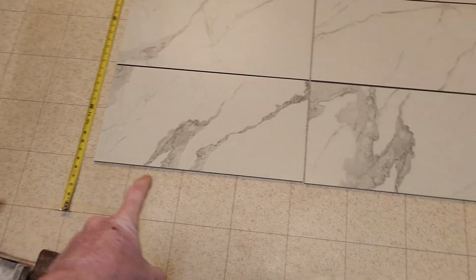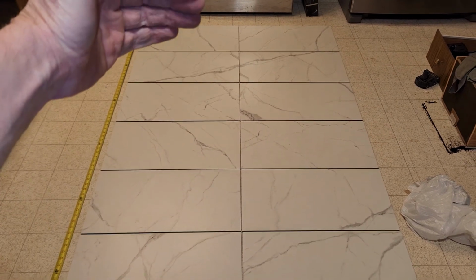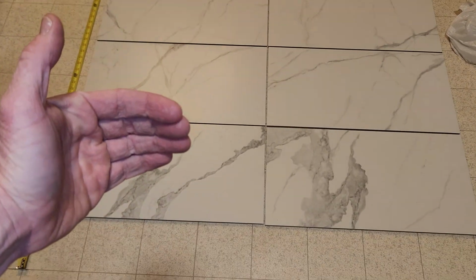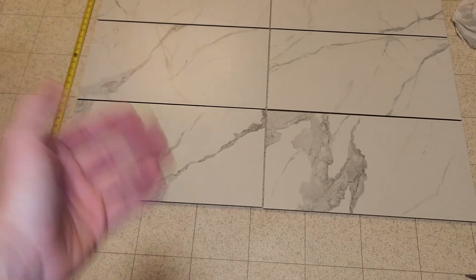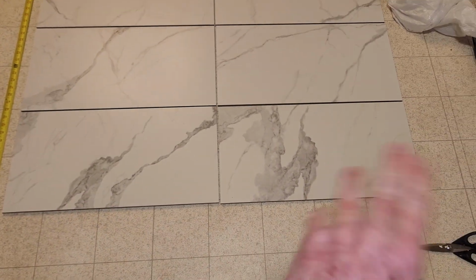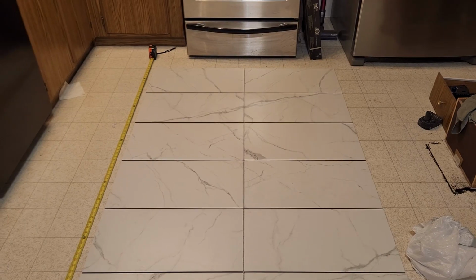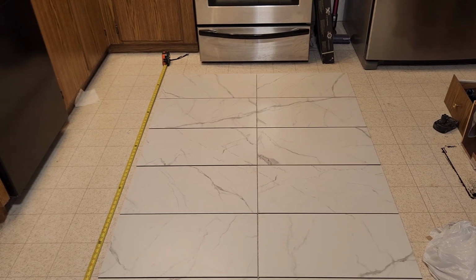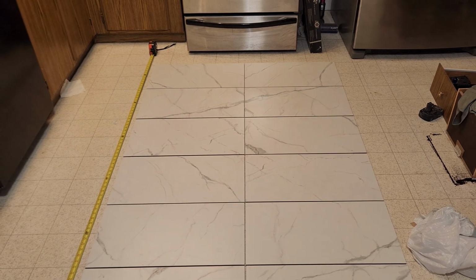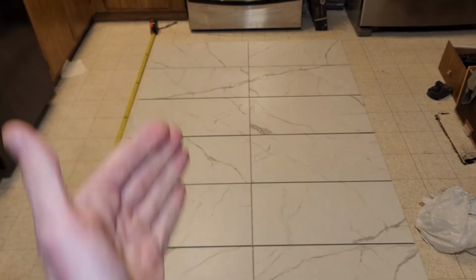So again, I'll put my wood piece right here, which has been very beneficial because that's a lot of weight coming down on your bottom tile, and it will kick out. So I've had no issues with the piece of wood, with my wedges, and the weight coming down on that piece of wood. Anywho, so get your measurements correct. That definitely helps out, and that's been tremendous on this project. Again, use your spacers on the ground here so you know exactly what you're dealing with here.